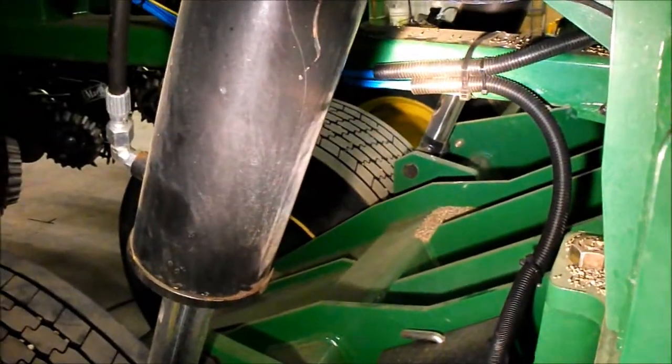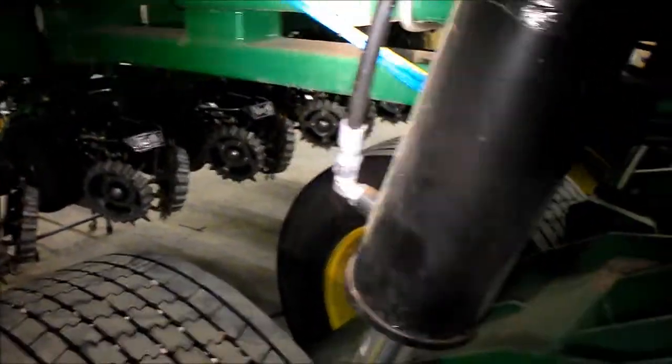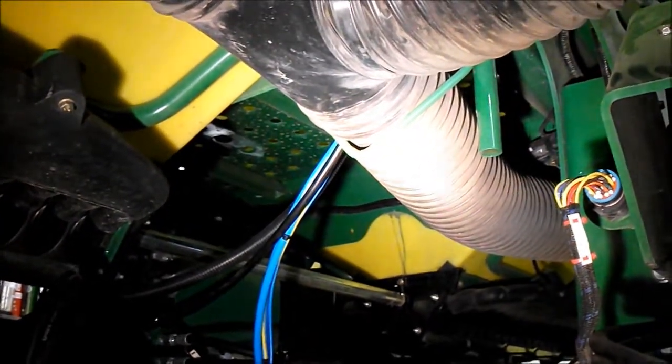We're going to measure out conduit to be tied down to get your length correct. It comes up and ends right beside the left hand side. Take it back down on the floor, string your 12 and your 4mm blue through it. Go ahead and mount it up so that the big blue and the small blue go up through the platform to your second box.